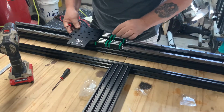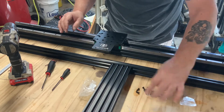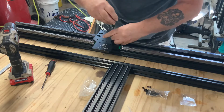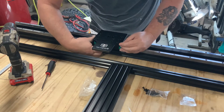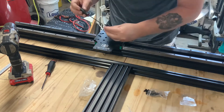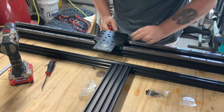After the nut blocks are installed, I then place the x-gantry plate onto the bearings, using the same process described in an earlier video for the y-plates to line up all of the bolt holes. I install all 16 bolts and leave them a little loose to ensure I have enough play for the acme screw installed later in this video.